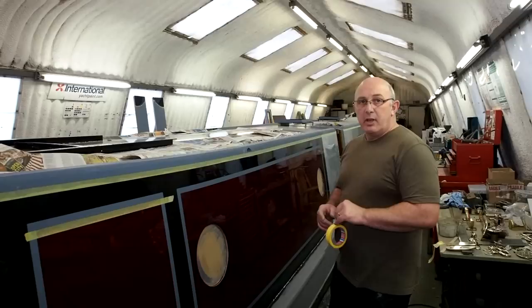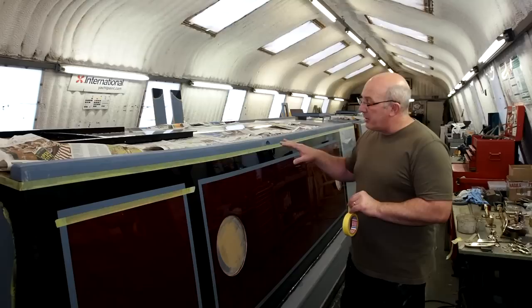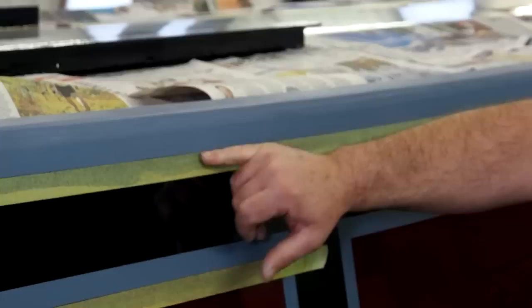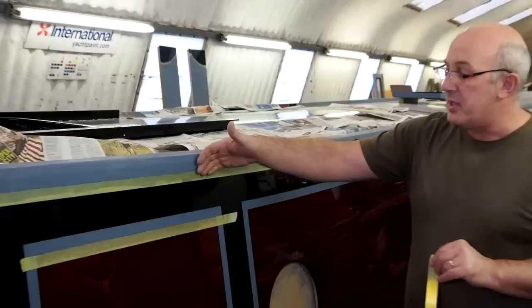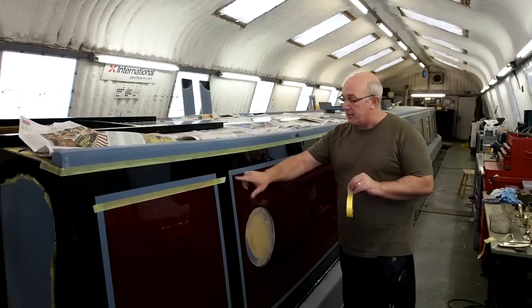We're back on the coach lines. We've jumped ahead 72 hours in the sequence and now we're going on to the taping. I've just gone down the hand rail — it's probably difficult to see but I'm leaving just the minutest amount of this black gloss showing above the edge of the tape. That's to ensure that when I paint the hand rail, those two edges are going to marry up and we're not going to get any missed pieces. Keep nice and tight and don't be below the line by any distance at all.